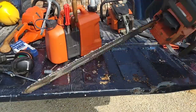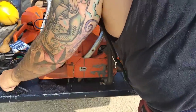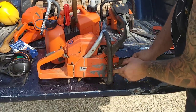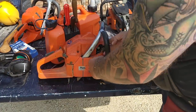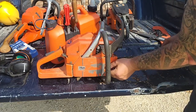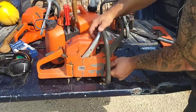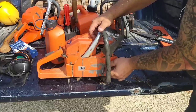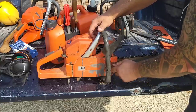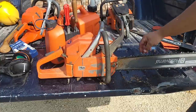So there you go. The stock C83 — it's okay I guess, but it's not anywhere near as fast as a quick hand file. EXL is pretty close, but even that I can do a little bit better. Remember, there's a reason why when you watch a logger cut, their cuts are smooth — they don't bog the saw down. That's 20–25 years on a power saw. A lot of people, when they see a logger cutting, go 'oh that must be soft wood' — it's actually not. The chain is sharp.